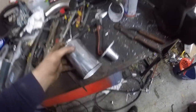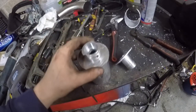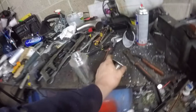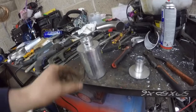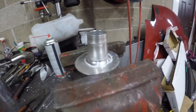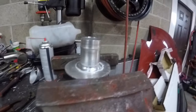So I've got the tube cut out, I've welded that piece onto the top of that, going to weld that onto the bottom. This piece isn't welded on yet but I'll press it in there and that'll go in the bottom. The next piece will be another pipe that'll come at an angle — that'll be the tricky bit. I've got a bit of meat on the sides so it won't crush or deform in the vice. We've welded in the bottom piece — this is the sort of weld I wish I could show you but the GoPro lacks the macro focus. That one turned out alright actually.